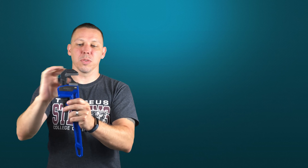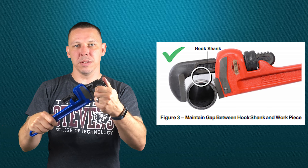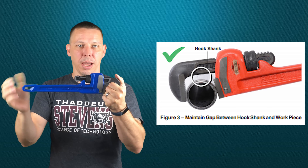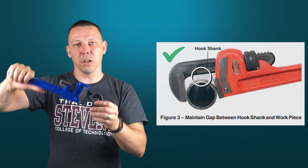These are only designed to turn in one direction. You put it on a piece of pipe and turn it that way — you can't turn it the other way because the jaw will open back up; it's designed to do that. The jaws are out of square so when you tighten down on the pipe it binds. If you go the wrong direction, the hook jaw releases and pops right off. To turn the other direction, just flip the wrench around and grab from the other side.